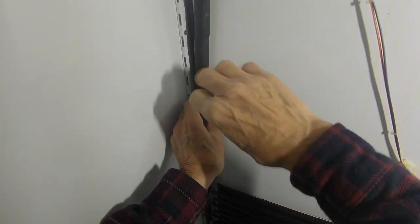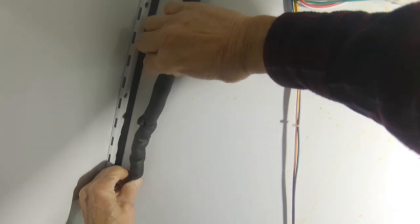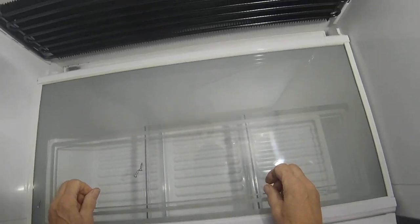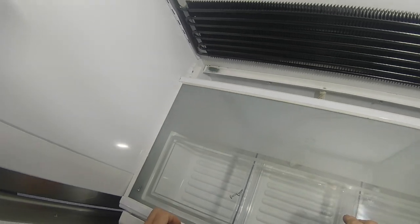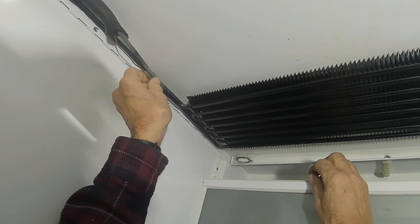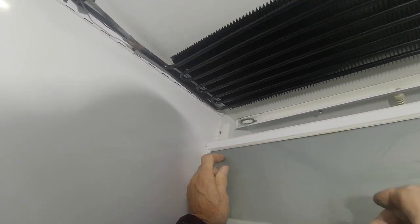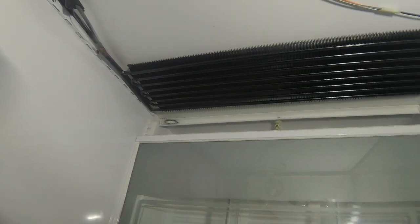Jeez. All right. Well, that's leading me to believe that we're going to have to change this evaporator coil and not the heat exchanger. But I'm still going to check for leaks. So I'm going to get my leak detection equipment, my sniffer and my ultrasound. There's some oxidation from here, but this is an aluminum evaporator, so there are no signs of this thing ever being replaced. So let's get to work.